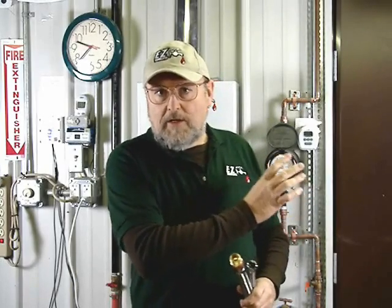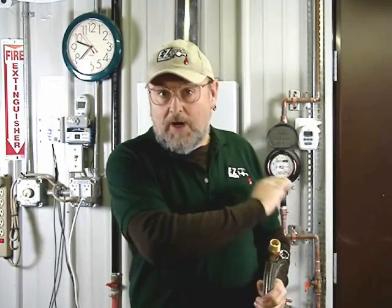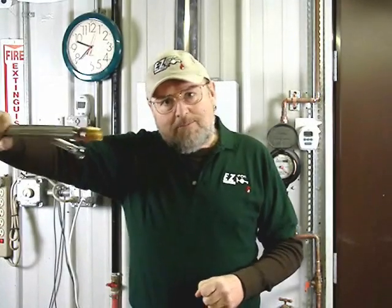And then when you have your new location for your tankless heater at an exterior wall, you've moved it. You have hot water coming out of one side into your hot circuit and cold water going into the intake inlet. You also have your old location now plumbed in cold water into your hot side. So as hard as your tankless heater works, it's not going to produce enough hot water because you're blending it with that old cold water circuit that you've now inadvertently plugged into the hot.